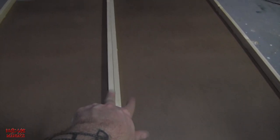Now this is a 2-foot sheet and that's a 2-foot sheet, and they meet in the middle. The reason I decided to change it is that the most bend for this table, I'm thinking, is going to be in the middle where the two panels meet. So by doubling this up in the middle, it's strengthening it. Plus, I go all the way down, running along just the outside.